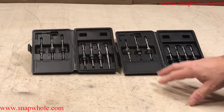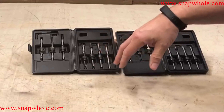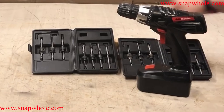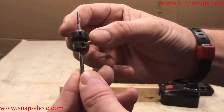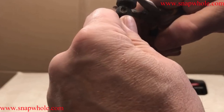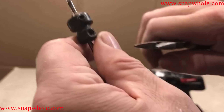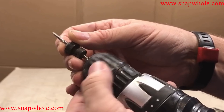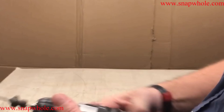Good morning. I shot the video the other day of using these countersinks and how they worked, but somehow the part of the video covering the demonstration didn't survive, so I needed to do a follow-up video. I've got my Drill Master drill and a piece of sample wood. I mostly use this size. You can see that it's canted sideways — that's a symptom of how you put it on. What I usually end up doing is taking a pair of needle-nose pliers and just twisting it a little. If you can get it in the right place with the needle-nose pliers, it'll stay in the right place while you're using it. It's very hard to get it perfect. Chuck it in the drill and get that chuck as tight as possible because it tends to spin.